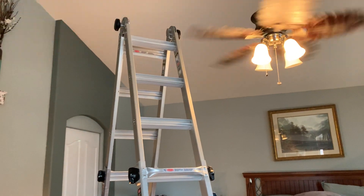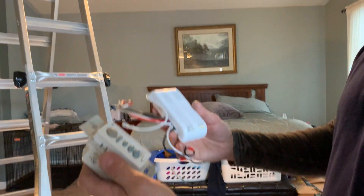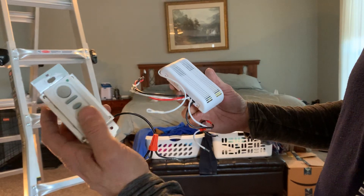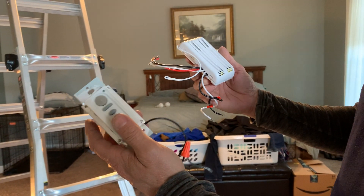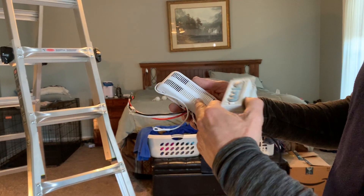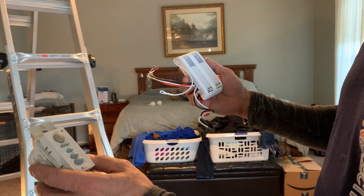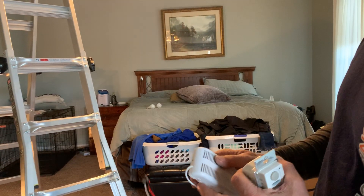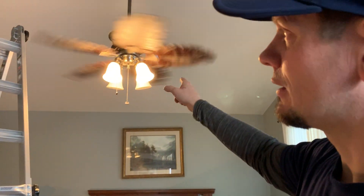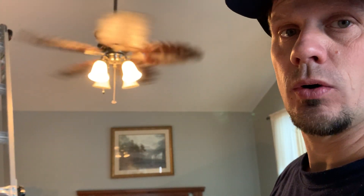Keeping in mind, this is a Hunter and this control switch acts as an RF to here. How do you know that? Because there's only two wires — it was still commanding an RF up here to tell it what to do. This push button was wearing out and finally died because they were mixing LED and incandescent bulbs with a normal bulb up there. It won't work.